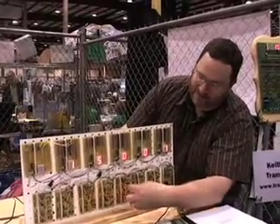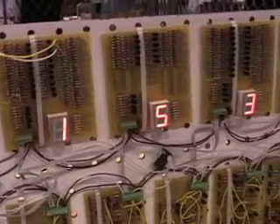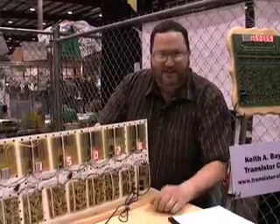Once I had all the divider boards working, I made a display board which takes the time — just four digits — and shows the time. Then I had to build the 60Hz extractor with some analog filtering. All transistors, no ICs — that was the fun of it. Once I had that working, I laid it out, which was a major effort — many tries to lay it out in a way that makes sense.